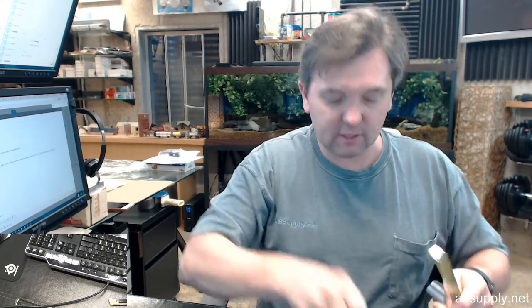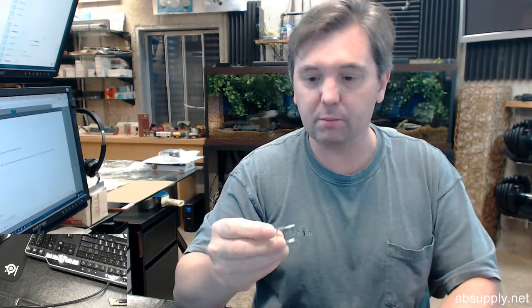Let me give you some dimensional properties. The outside dimension of the cylinder collar looks like it's about 1.5 inches. The thickness of that cylinder collar looks like it's about 5/16. I'm going to give you an inside diameter: .379. Inside diameter of the backside, just because we're measuring, 1.157. And of course you've got that wave washer that's there. It's a very thin piece of material, and that will obviously flatten down significantly when you install that cylinder.